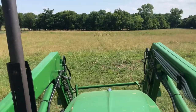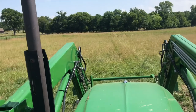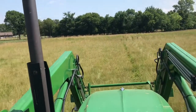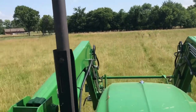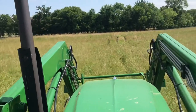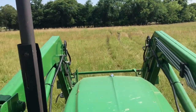Now I'm going to fill it up for tank two. I'm going to up the pressure a little bit and keep the spacing tighter, because it should be two and a half tanks of Duracore mixed with water to spray that field. The trick was overlapping the tracks — basically every time I go through I drag the wheel in the last rut. I've got the pressure up to 25-30 PSI. I'm just about ready to fill up again but I'm only going to do a half tank. I've done over two-thirds of the field so I'll keep track of the math. Two and a half tanks for 10 acres — I think it's going to work.